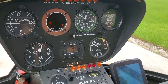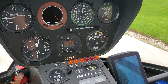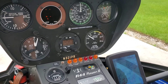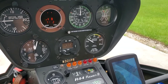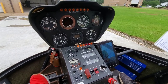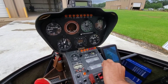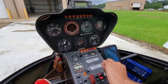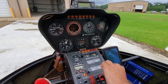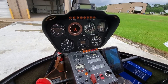Can you feel that vibration? That's the governor trying to take it. Let me help you there — give it a little tiny adjustment, very sensitive. Right at 75 right there. So go ahead and turn two clicks — one thousand one, one thousand two. Click it back. Alright, we only lost about four percent. Let it settle. Do one more click — one thousand one, one thousand two. Back. We only lost two percent.